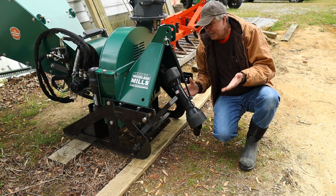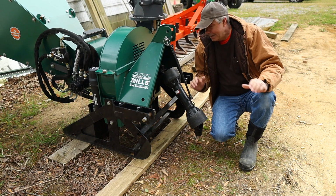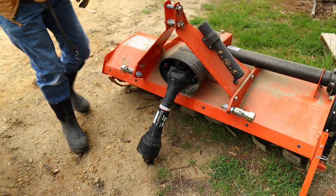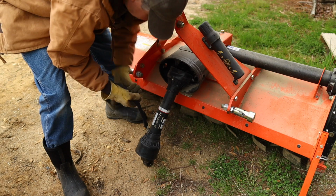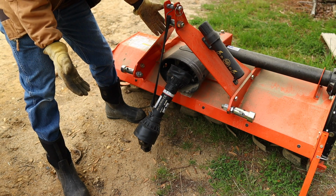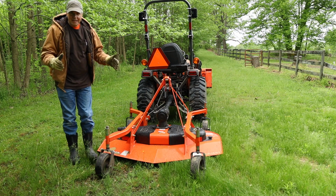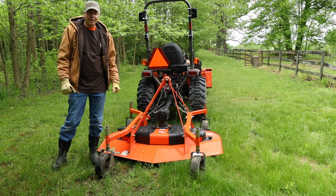It hangs out of the way, and it just has been a true lifesaver and has made hooking this unit up so much easier. Now for this one, I just hook the bungee into the hole of the safety sleeve, pull it up, and hook it onto the pin where the top link goes, and now it's stored until next time. Well, there's your simple tip for the day. Nothing earth-shattering, but definitely can make your life a lot easier.